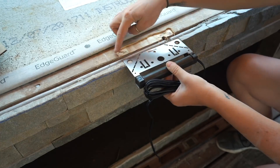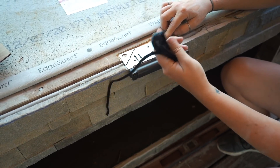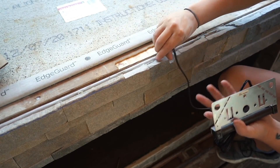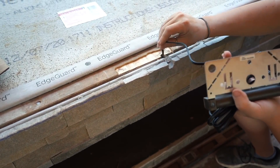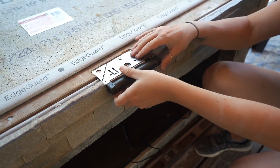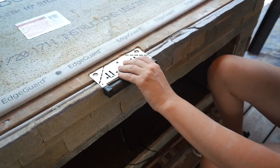For the log boxes, all of their framing easily goes into the chimney framing, which holds the box. Before I poured the concrete countertops, I did the same process as the post boxes — routed out a cavity to make sure the light will sit flush, then drilled a hole to fish the wire through.